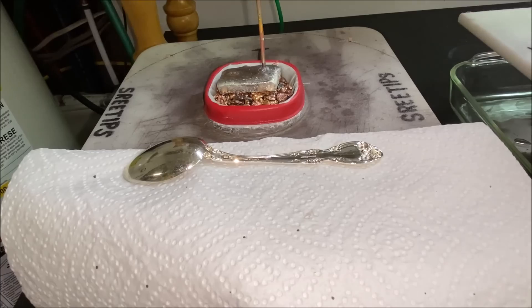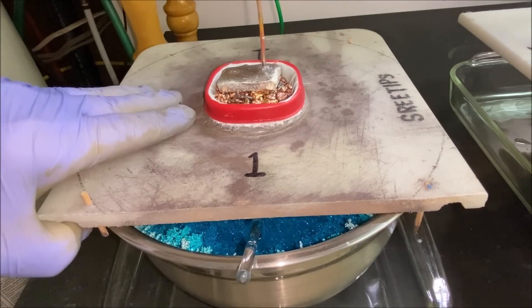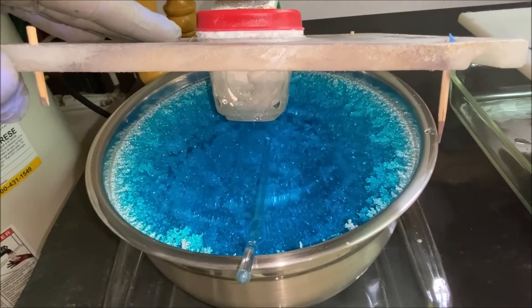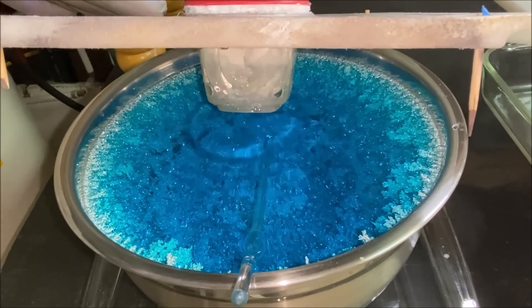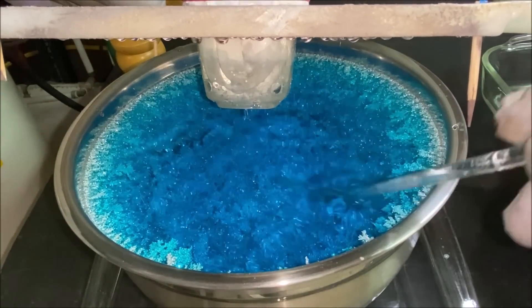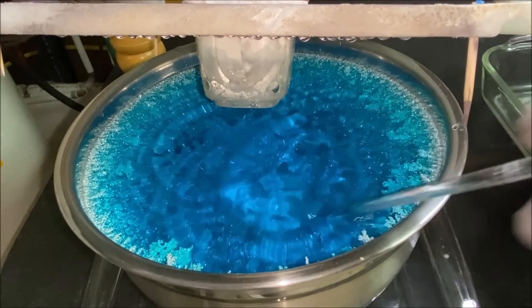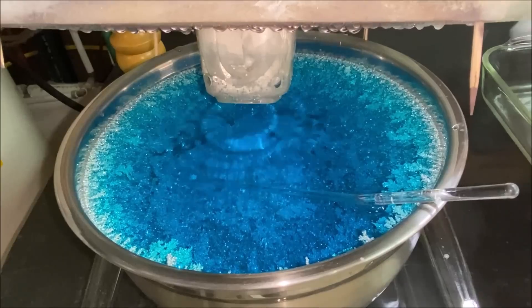Let's look down in cell number one and see what's going on. You can see the higher conductivity, higher current flow — cell number one is cranking out some decent pure silver crystals here. I'm going to give this just a touch of electrolyte.